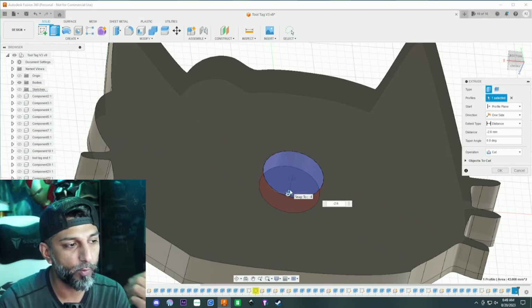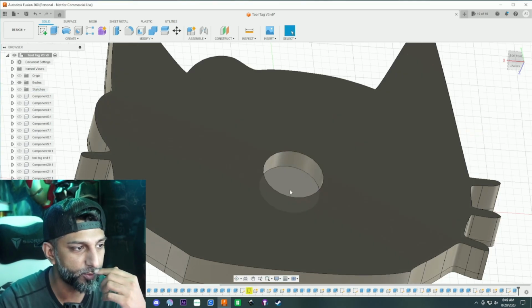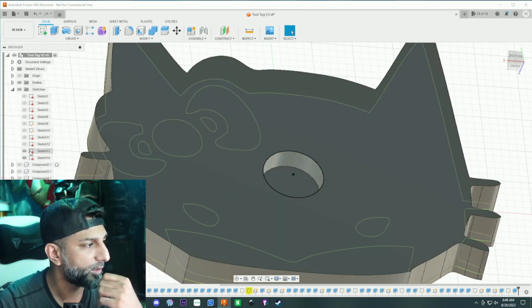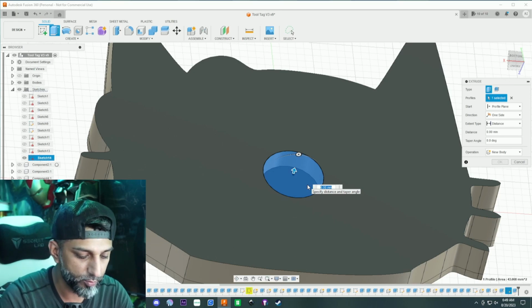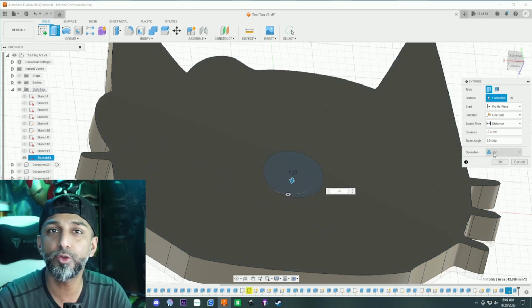Now when I bring 0.4 back, the offset that's going to be left inside is 2.2 millimeters, right? So 2.6 right there. I'm going to bring my sketch back. Okay, I got my sketch back over here. Then I'm going to click the sketch again, and do E for extrude, and do negative 0.4 millimeters, but this time we're going to leave it on join.